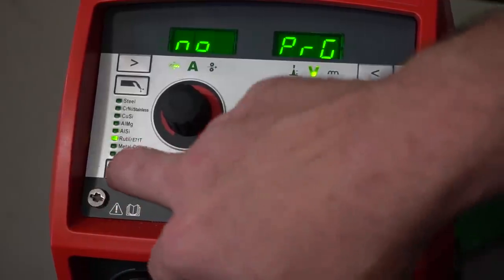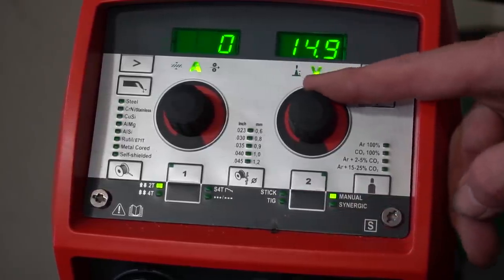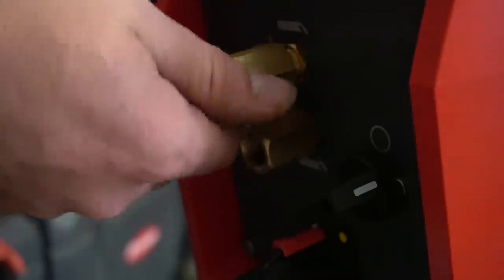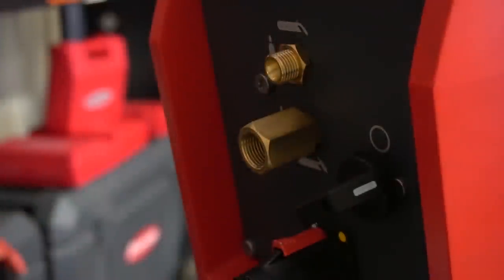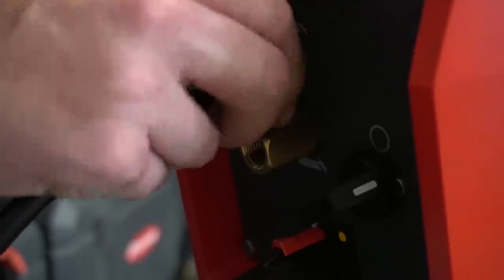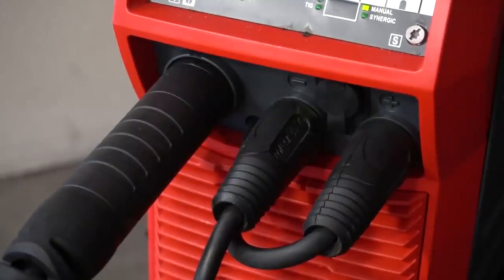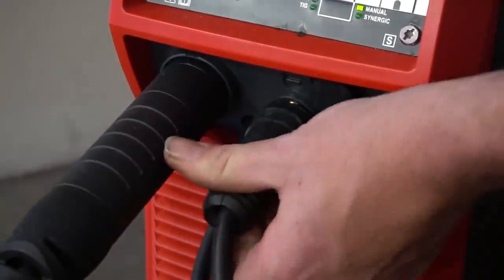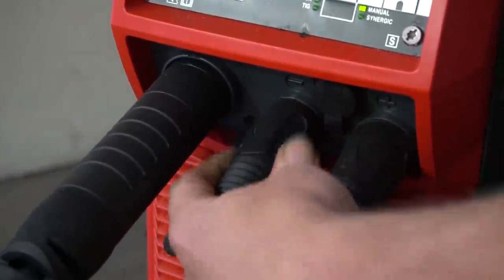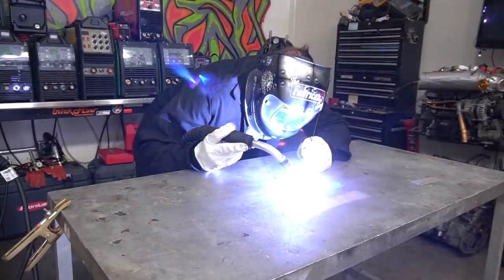I have my Fronius Transteel 2200 set up to run in synergic mode, but I don't need to weld like that. I'm going to go to manual and set this around 16 volts because I'd like to do a lap joint — an eighth-inch lap joint on some stainless steel. If you have a multi-process machine that has dual input gas solenoids, make sure you put it on the MIG side. And speaking of gas, we're going to run 100% argon — no steel mix, no nothing. Just 100% argon to run TIG. Most importantly, make sure you convert your machine over to DC electrode negative, meaning the MIG gun itself needs to be negative and the clamp or ground lead needs to be positive. Otherwise you're frying tungsten.